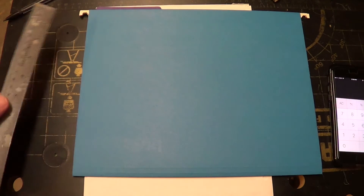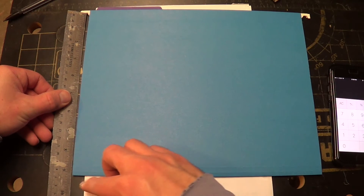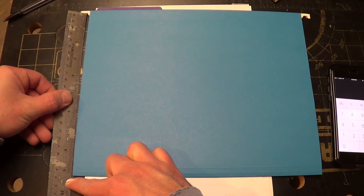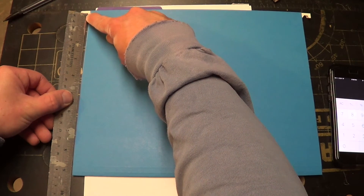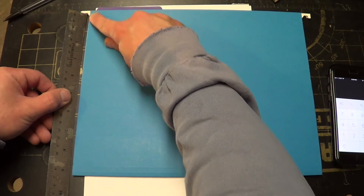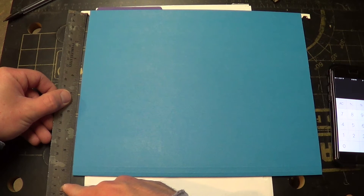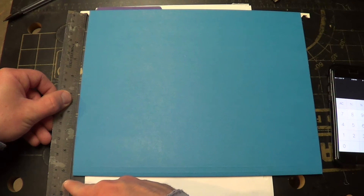Another aspect to talk about for these file folders would be the height — I've got to make sure my box is tall enough. If I go from the inside part of that hook all the way down to the bottom, I'm reaching right around nine and a quarter. I'm going to want to have a little bit of room to play with at the bottom, so if I went to nine and a half, that'd be perfect. Also, I'm going to add a little steel piece in the top of those pieces of plywood in order to hook on to these guys, and that's going to be sticking out proud about a quarter of an inch from the top of the plywood. So I'm essentially subtracting a quarter inch from the top. If I add on that quarter inch at the bottom for a gap but then subtract it for the steel piece, I'm back at nine and a quarter. So if the height of the inside of the box from the top all the way down to the bottom is nine and a quarter, I should be money.